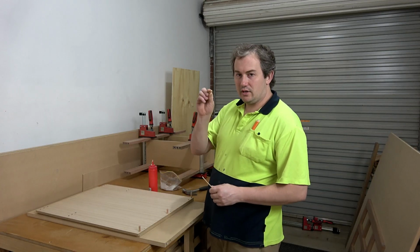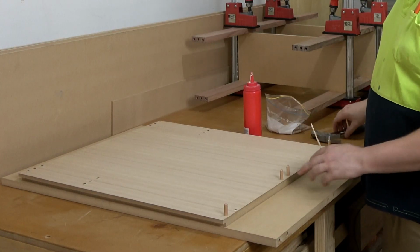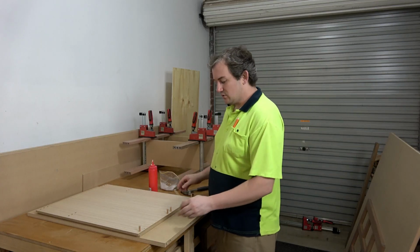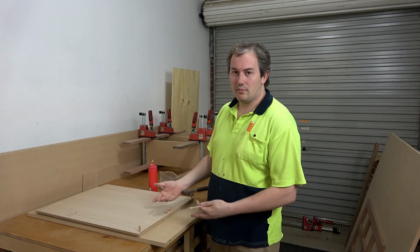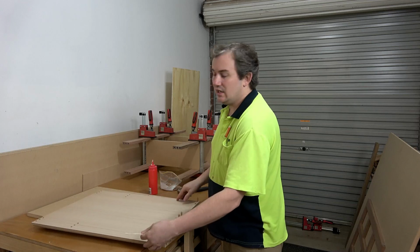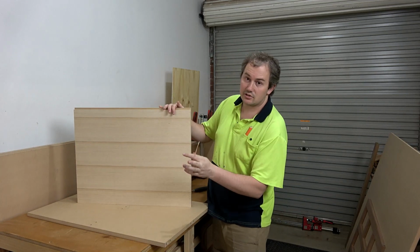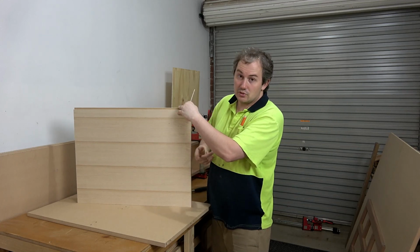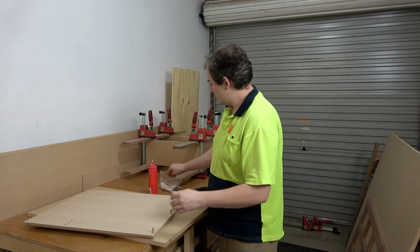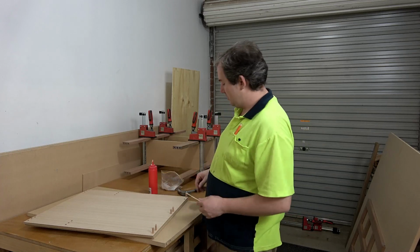If you ever need to hammer in a dowel into the side of a veneered MDF panel, do it very, very gently. Because what happens is, even though I've got a solid backing behind it, if you punch it through, you'll end up putting a little dint on the outside, as if something's poked through, because something has poked through, it's the dowel. So you want to be real gentle. It's good when they're kind of loose, they just slide in there.